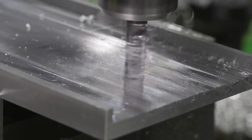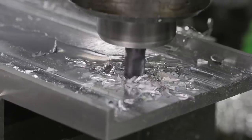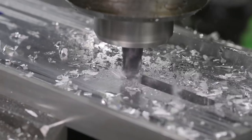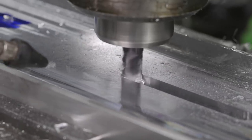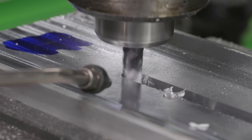The last step in this entire build process is to cut the slot for this to slide on. I'm using a brand new half inch end mill and taking a full depth cut which is about 12 inches long. I'm taking it slow, and it is aluminum, so it was cutting rather easy.